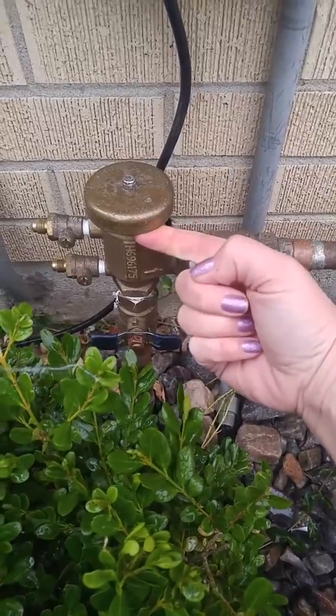So I'm going to slowly open the valves. Water will gush out the top until it pressurizes. And now slowly open this one. Water will flow through the pipes for some time until it reaches the manifold where all the valves are to each zone of your system. Let it slowly fill, slowly open. You could even turn on one zone of the sprinkler system while this is filling so that there is reduced pressure hitting the zones all at once.